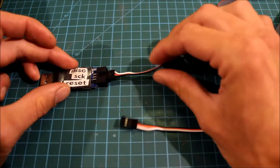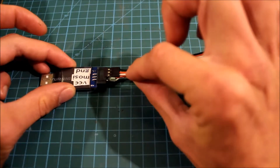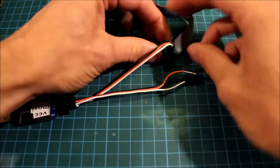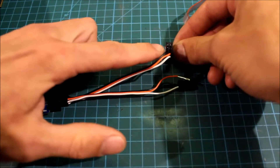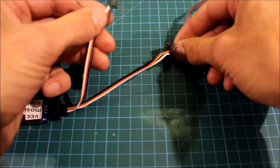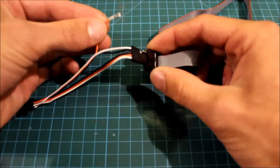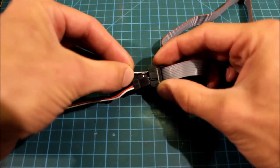You put the black wire beside the white and you leave the red. Now you turn around your USB-ASP programmer — black is GND. Plug it in. The second pin on the left is your GND. Plug it in like this. And then your last wire, your MOSI, will connect on here.